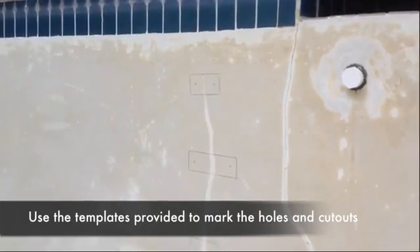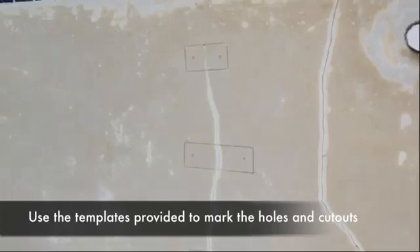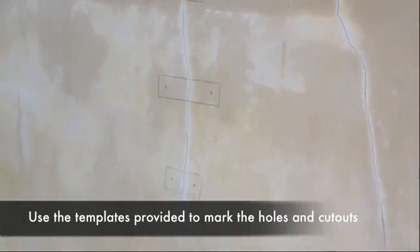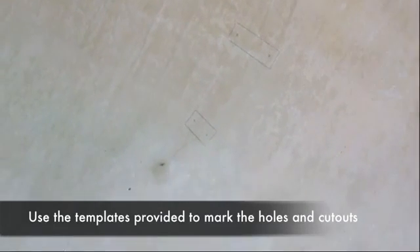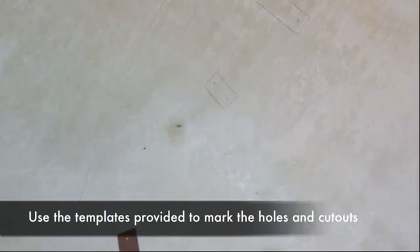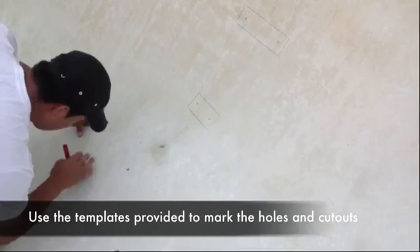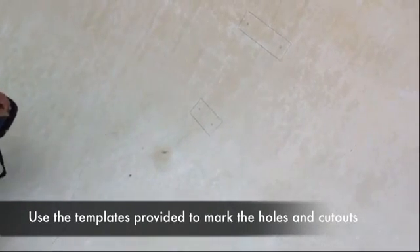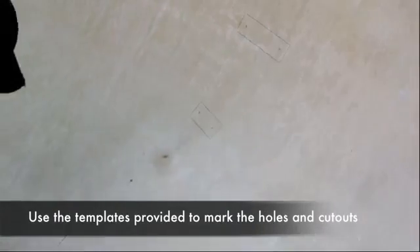Here's a crack that we marked out. We marked the templates every 12 inches — three, six, three, six, three, six. When we get to the very bottom of the actual crack, we mark it with a very small round hole, because we drill right through the structure at that point. Being careful to make sure we're not near any lines. What that does is it creates an expansion joint and doesn't allow the crack to go any further.